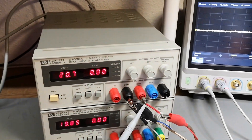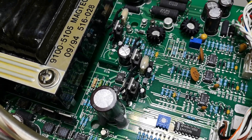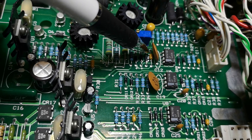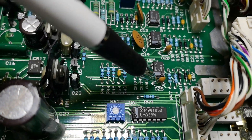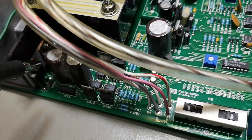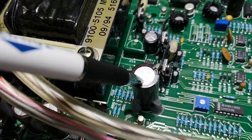I just couldn't let this go. In the manual there is actually a troubleshooting guide about those oscillations after load drop and unstable load drops. They talk about capacitors - the first things they mention are those tiny little capacitors C11, C20, and C25. I don't really believe those are the ones to blame. They also talk about the output capacitors and the main rectifier capacitors. I've been through all of these and I don't see any problems.